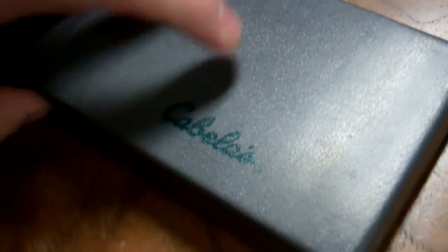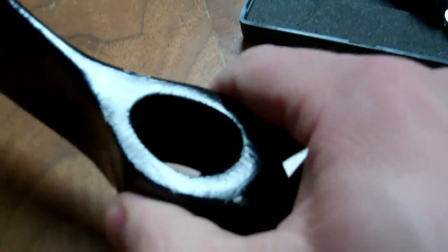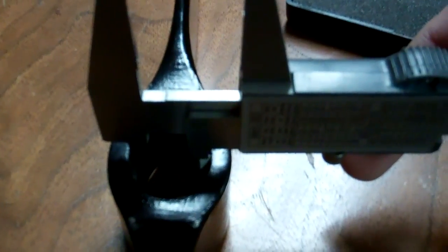But let's look at some hard facts. I've got a meter out. So we're going to meter it out. I use this for brass reloading when I reload my rounds to make sure they're the right height, the right OAL. Let's see if I can do this on camera one-handed. All right, clear that. It is on inches right now because that's what most of us who watch this video use, I believe. Okay, let's do the bottom first. Let's do the width. I'm using the top. Oops. So watch what I'm doing. There we go. That's about right. 0.982.